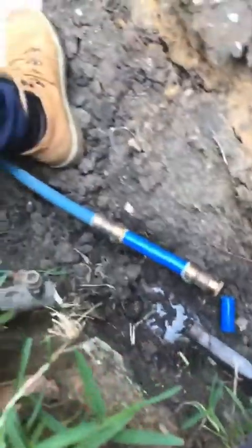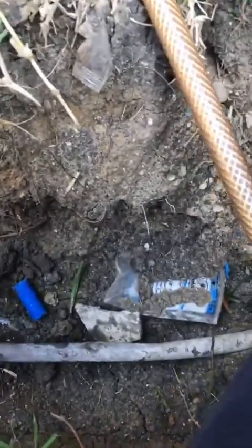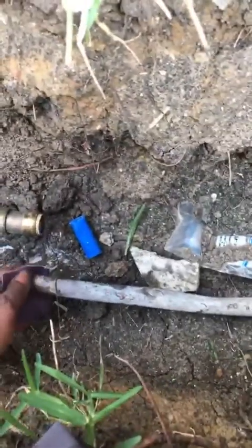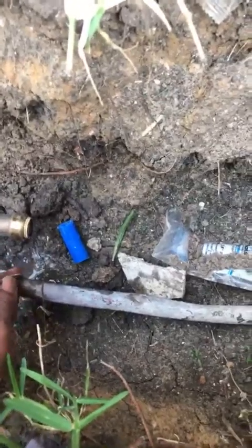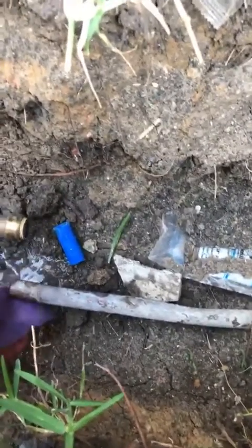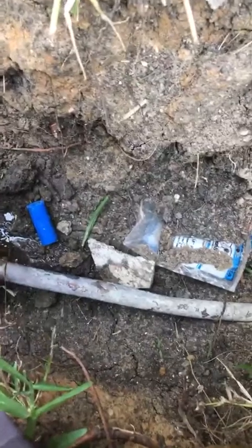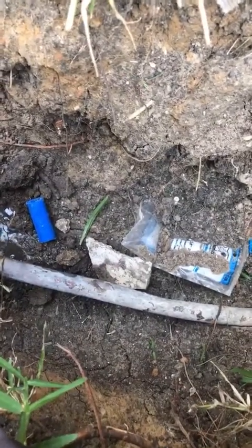All right. So you want to repeat the same process as you did with the PEX pipe. You want to take your sandpaper and run it along there real light around the edge, just so you can get all the burrs off. You don't want one of them breaking off after a while and being in your water. All right, that feels nice and smooth.